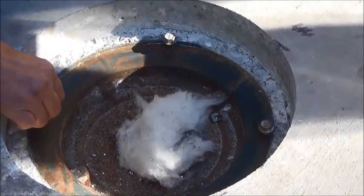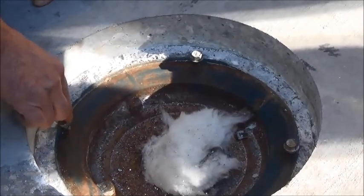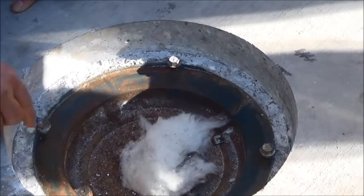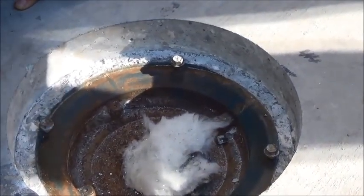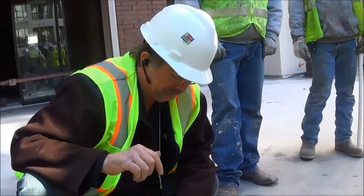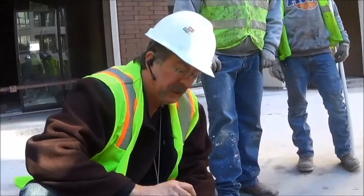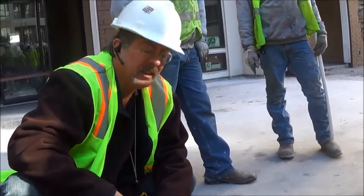Your bolts are going to be Home Depot, Lowe's, whatever you can do. Pull these bolts. Don't lose them, right? It's just a pain going out buying more. They do sell these at Lowe's and Home Depot. But you want to put a temporary bolt in there, and I always keep them real high, like 6 inches, only because if you use a smaller one, you'll bury the whole thing. You won't see it. So I use the bigger ones, and if they come out later after the hot rubber, fine. If they don't, just give it a little heat, and then yank them out.